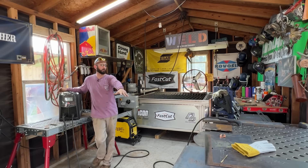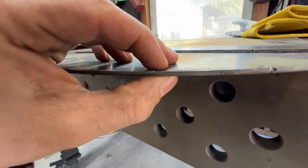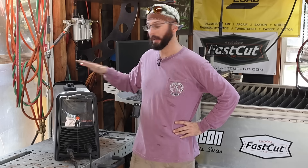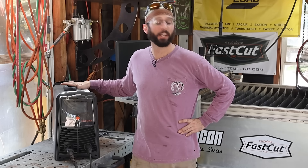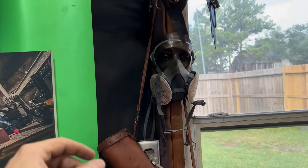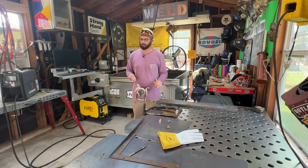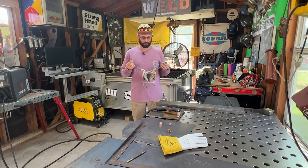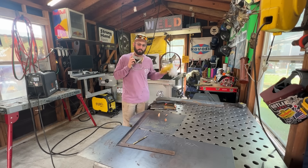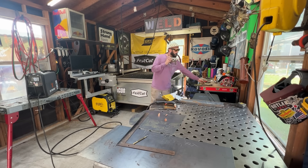When I go into cutting what we've got today — which is closer to 16 gauge, 10 gauge, three-eighths plate, and a whole inch thick plate — I'm basically going to leave this machine wide open and cut through all of these. I am going to run a respirator to keep our PPE up. Plasma cutting puts off a lot of bad fumes, so we want to stay protected. Wear your gloves, and I've got some shade 5 lenses I'm going to swap onto my glasses.